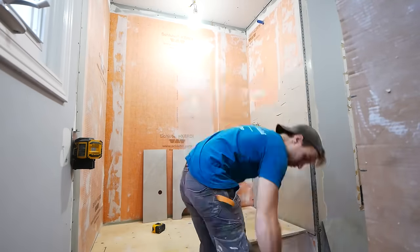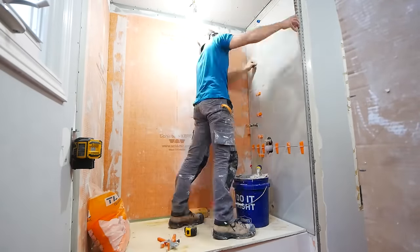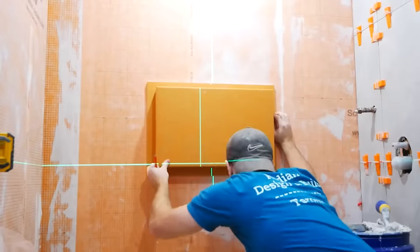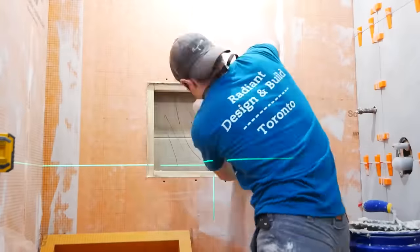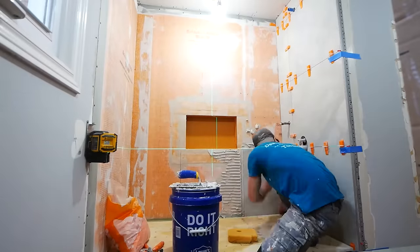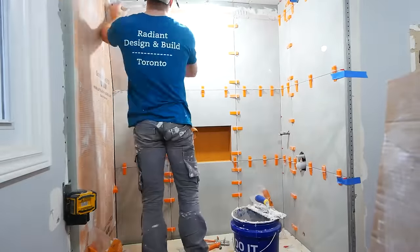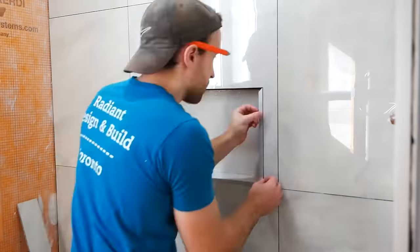This is a 24-inch by 24-inch glossy tile. I use the wedge tile system as always with 1/16th inch grout lines — I really don't like larger grout lines, but 1/16th is small yet still lets you keep everything nice and tight. For the niche, I get my laser established on the other wall to determine the bottom grout line, then cut it out and install this 20 by 12 prefab niche, with the bottom tile going in first to get the desired slope.